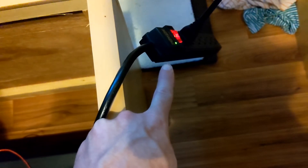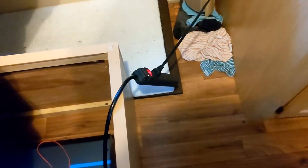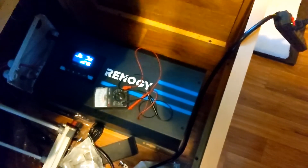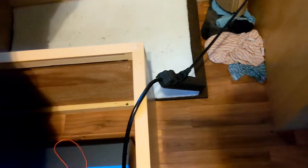The plot thickens — that's down to 12.3 again. The surge protector popped. I wonder if there's too much power coming through the surge protector and it can't deal with it. When this popped a second ago I reset it and then this was reading 12.8 volts, which sounds much more reasonable for what the battery should actually be at right now. So this thing may be the issue.